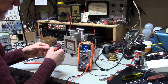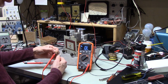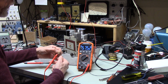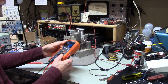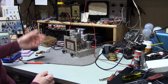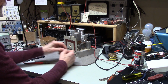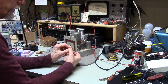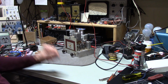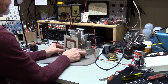This one is supposed to be 470, I think, 470. Oh, it's an overachiever. It's not as bad as the others. So it's 100 ohms more than it's supposed to be. So that got replaced. I just figured it's not going to improve with age. 10% of 470 would have been 47, and it does have silver on the end. So it was outside the appropriate value by more than double. So this little thing is actually working quite nicely.